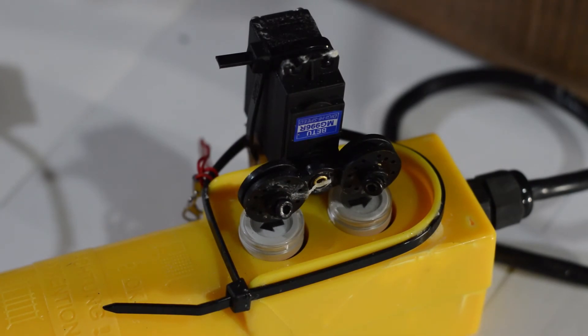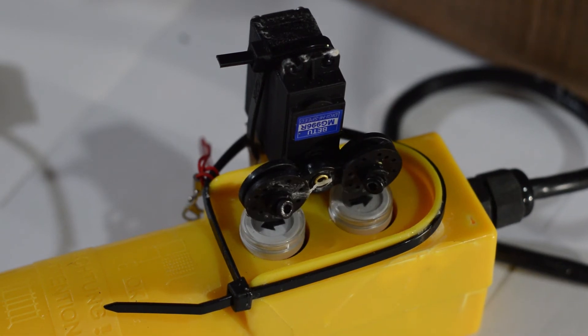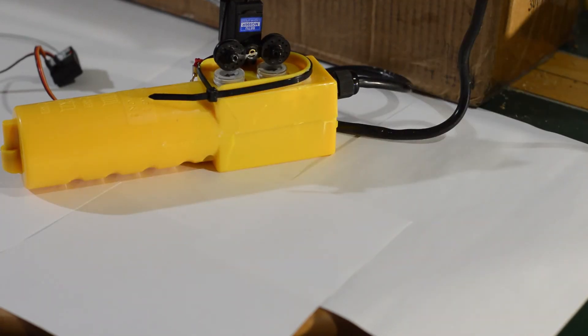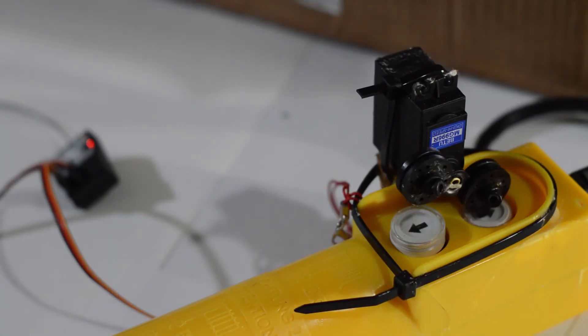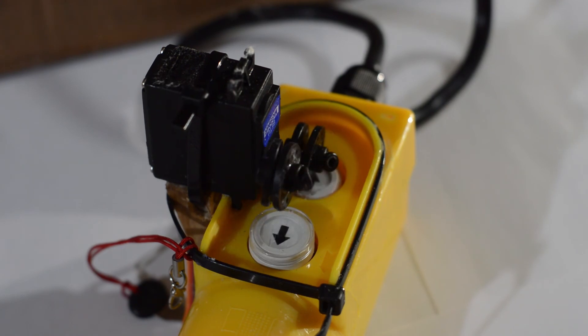Since the last video I've modified this a bit — I've added an extra wheel onto the touch arrangement so the mechanism hits the buttons more centrally, hopefully making them last longer. To sum up: I super glued the servo onto the button box, then put a small wedge of plywood underneath it to stabilize it. I also wrapped some straps around to stabilize it. That super glue holds it to the button box like nobody's business. I'm not advertising for any of the parts or for Amazon, but I've shown you absolutely everything I needed to order to do this.